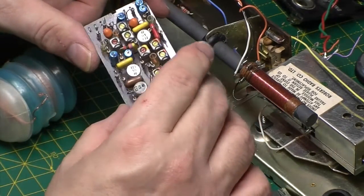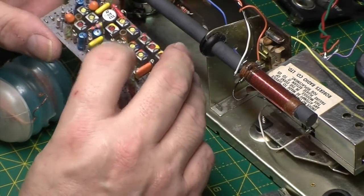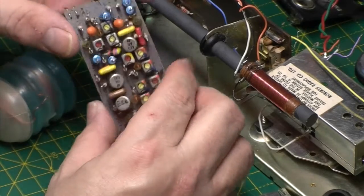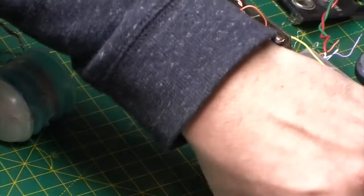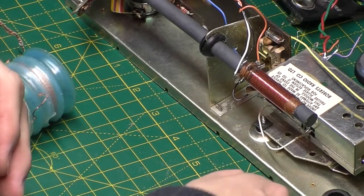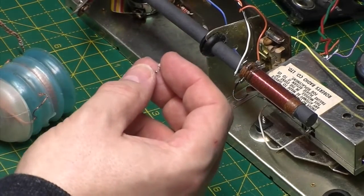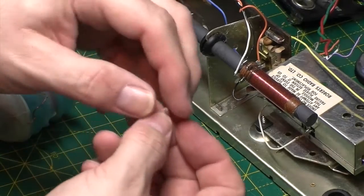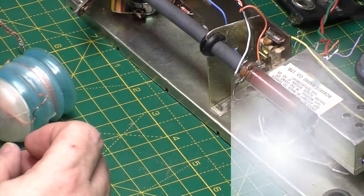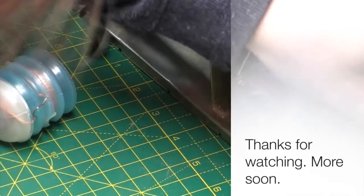And we have 2 AF115s and an AF116. Look, it's very nice. Anyway, that one will go to one side and be refurbished for the next radio. Incidentally, one of these resistors has fallen apart as well on the switch bank. Rubbish. Don't know whether that was dodgy originally, but there's little end caps come off. Doesn't look like it was fixed properly. But anyway, let's move on.